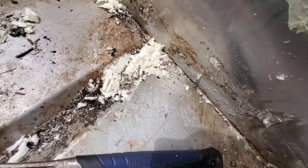Now time to frame the top up. All right, measured center and then made my cut, 20 inches. This is gonna go in like so. I'm gonna rivet it in place. Got that in. I'm gonna add another piece of angled aluminum across the bottom, and that's gonna create this mirrored on the bottom for the plywood to go in from the backside and then attach. Before I get ahead of myself, I'm gonna spray some naphtha inside of here and wipe everything down.